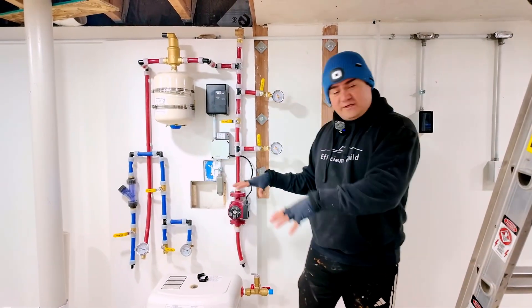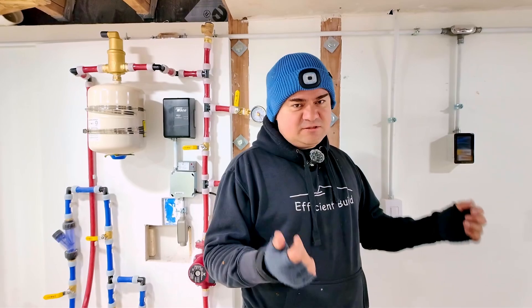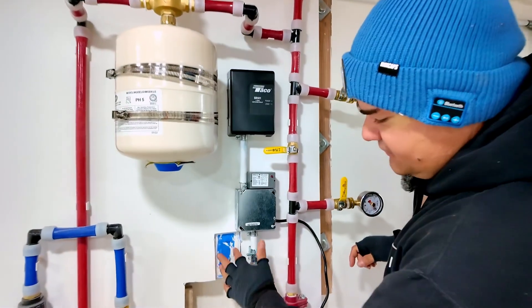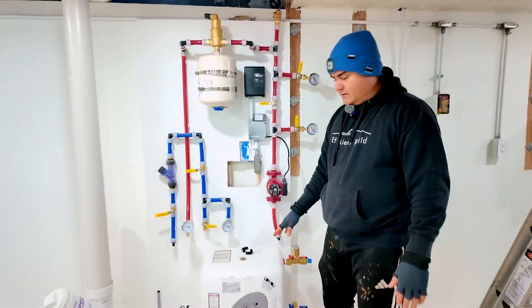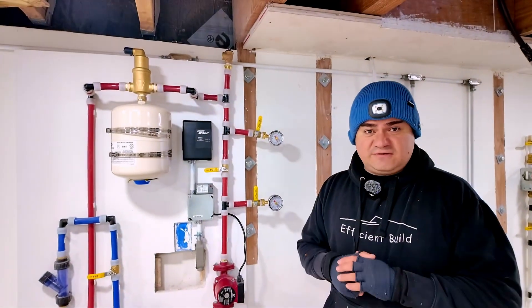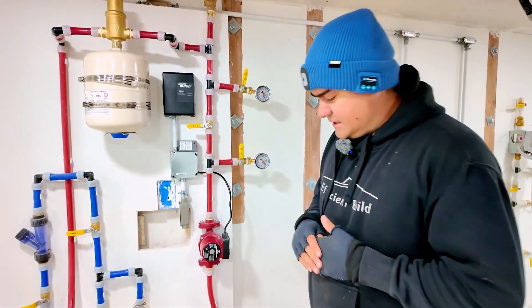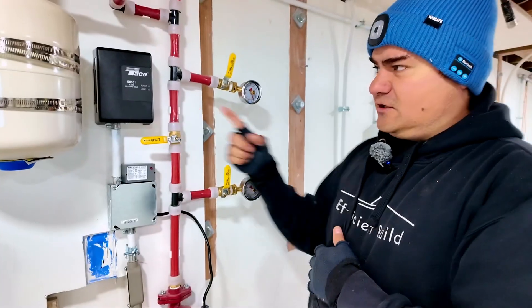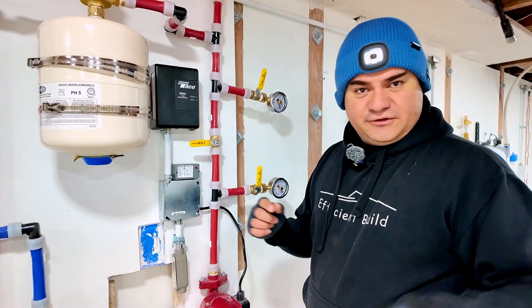We have hooked up all the electrical for the plumbing of the radiant heat. I'm going to show you the components and then go to the computer to show you the electrical diagram wire by wire. We have the controller here — this is basically your thermostat. This is where the sensor goes from the floor; it only needs one sensor but we have two because we have a spare in case one fails. This cable comes all the way around and out of this little box. We decided to give it its own 20-amp circuit — exclusive 20 amps for this tank because it consumes a lot of power. It can run on a 15-amp circuit, but because it consumes so much we gave it its own power.